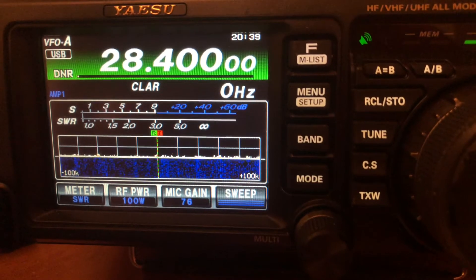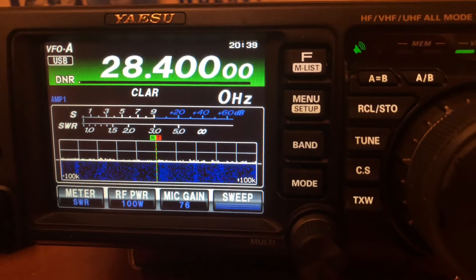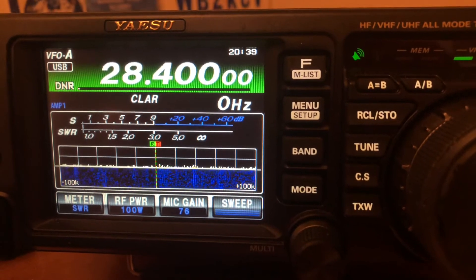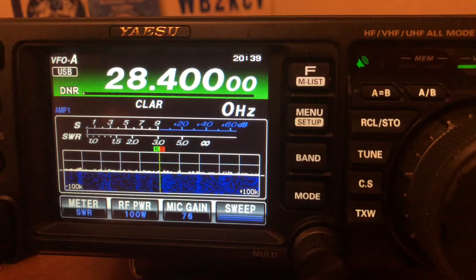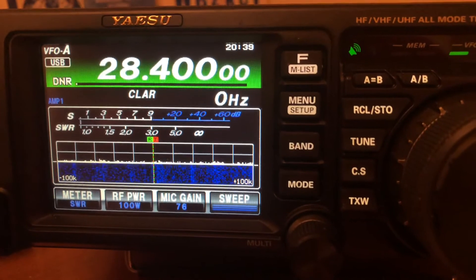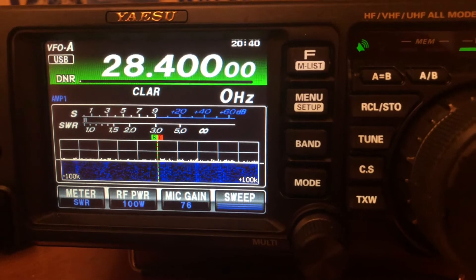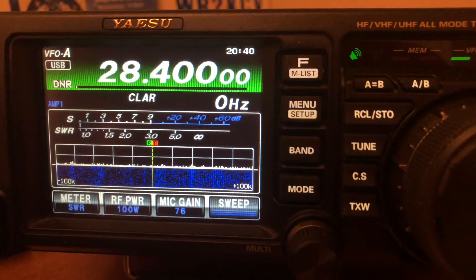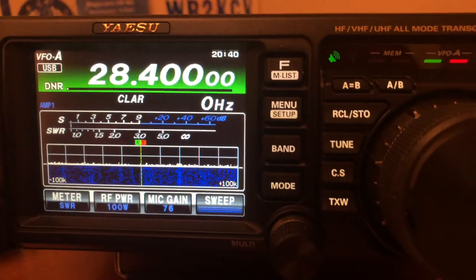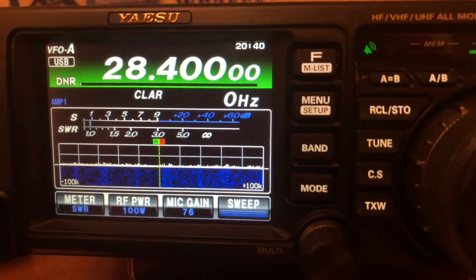You can tune it on 20 meters — I did try that — but it's compromised because if you do the math it would only be a three-eighths wave vertical, like a vertical ground plane, three-eighths of a wave on 20 meters. So it's time to bring out the big boys and get like an 80 meter half-wave dipole out there, hooked up to a tuner to work from 80 to 10 or whatever.